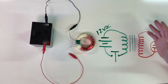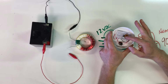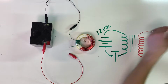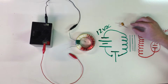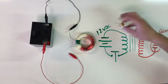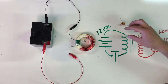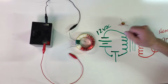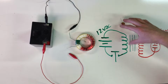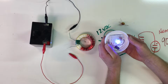So that is similar to what happens in the Joule Thief circuit, where there's a primary side and a secondary side of the windings. It's like, here's a completed coil, and we're charging up one side and then using the induced voltages back and forth to make the circuit behave the way it does, to oscillate, and also to make a rapidly collapsing magnetic field that boosts the voltage in the secondary coil, which fires the LEDs and makes them light up.